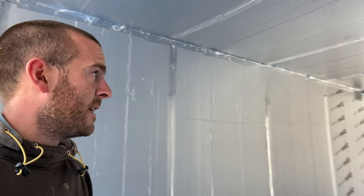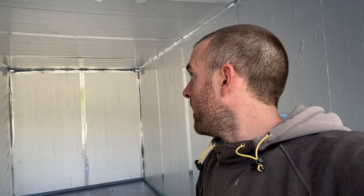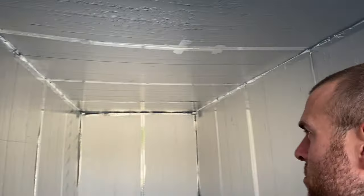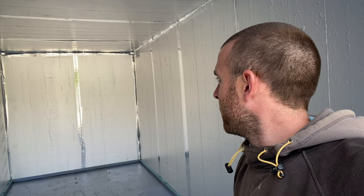With all this insulation I've got so much light in here, because having the foil side facing in is great for reflecting light. But the biggest thing is I don't want any condensation in here, I don't want massive fluctuations in temperature, and I just want things to be dry with no drips. All this insulation is going to do that perfectly, and I've got four vents on this container, so I won't have stagnant or mouldy air — it's ventilated but protected from big temperature swings.